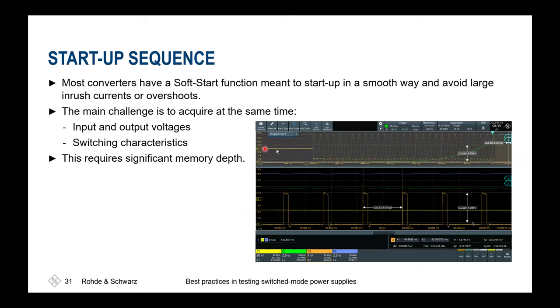So a typical startup sequence is shown here: we get the sine wave in the back, which already starts as maybe a clock. Then other consumption at the bottom is shown for a certain voltage level. Ramp up takes place, and all these timings could then easily be measured using cursors, maybe automatic measurement functions, or also gated measurement functions, meaning you add different timing gates to do different measurements and see at the end if your supply and your system match well together, or if there are hiccups. It might not take only 8 cycles, it takes maybe 8.5 or 9 cycles to get the reference voltage out of a certain switch power supply. And then you could start debugging in your design how to power up these different supplies and still ensure that you're not exceeding the maximum power consumption at the input port of the device, and also ensure that a sufficient amount of power is always provided to the different parts of your design.